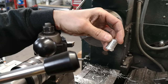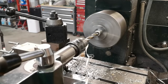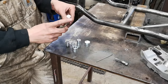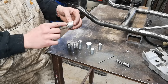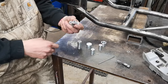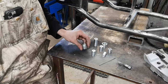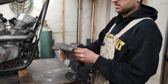That should hold a hose — just got to drill a hole through it. These took forever. I've got two. I drilled a blind hole in these and then tapped them for M8 — those will be the mounting studs. This is the outlet. I ended up having to put a weld bead around this, then shaped it and drilled a 20-millimeter hole through that. These are the inlet ones, and then I made a quarter-inch NPT for that temperature gauge. I eyeballed that stick and this is all I was left with, so I did a pretty good job.